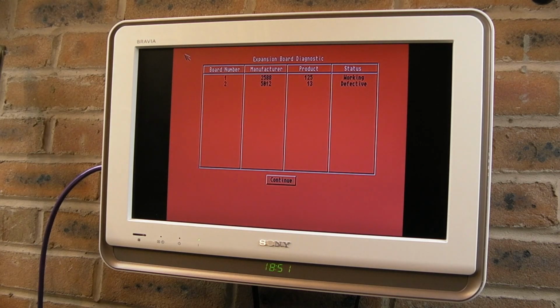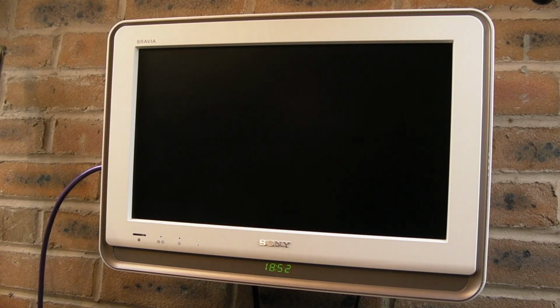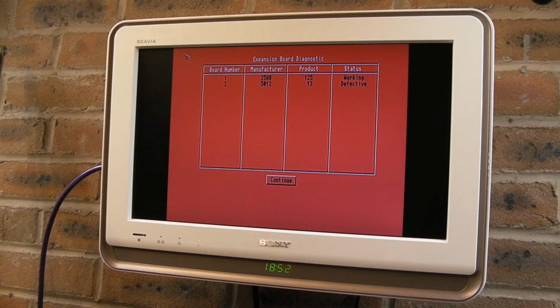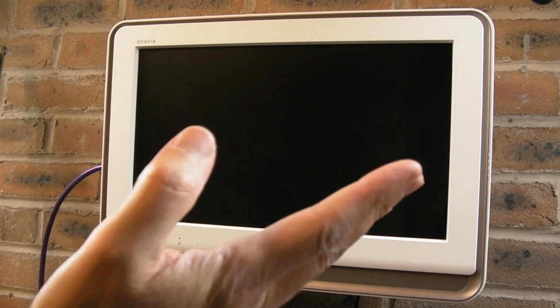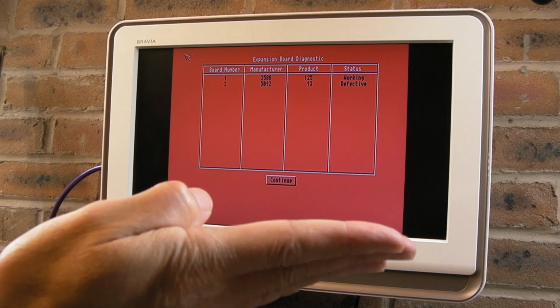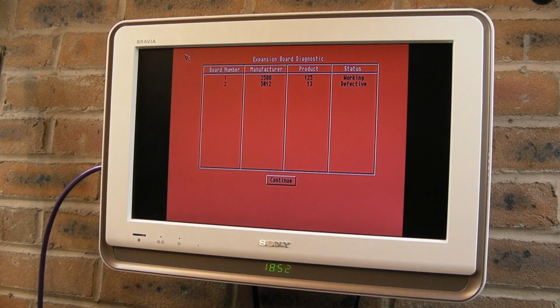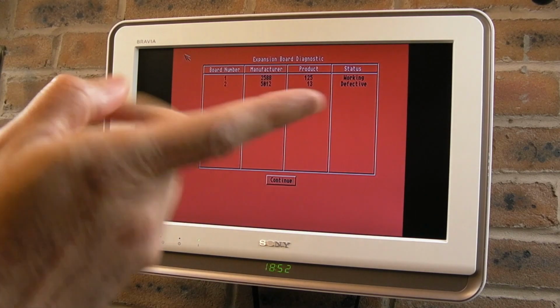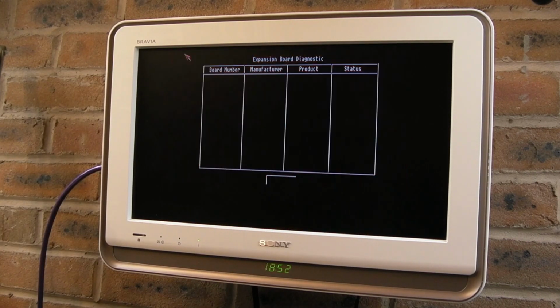It's a cheap LM339, is that the problem? Maybe the threshold needs changing, because I don't know how they're doing it. I suspect they're doing it on the 5 volt level. So maybe the 5 volt level's just a tiny bit low, it's borderline, and then over time it warms up and the devices start to consume a little bit more current and the 5 volt level just drops a tiny little bit, and then we get into this reset scenario. I bet that's what it is.